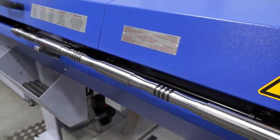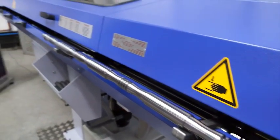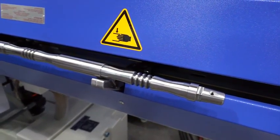I can see why you've chosen to show this particular application, because as I look at this shaft, I wouldn't associate this with a sliding head lathe, so it's very different. We've got lots of customers that are doing longer parts than this, but we felt a 1 metre part was a nice round number and maybe not as complex as this particular component, but it does show the versatility on the 32J. And obviously you can see, it's a very nice finish. We're turning very close to the guide bush. So it's a very traditional sliding head component, but on a much, much bigger scale.